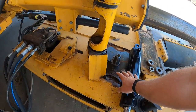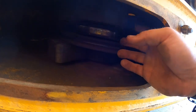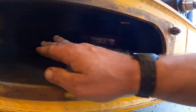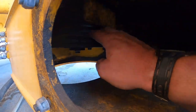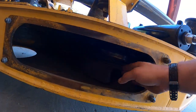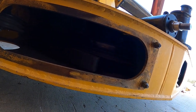So here's what we call our energy wheels inside here. These are the wheels that actually have the weights on them that cause the shaking action. You have your lower wheel and then your top wheel, and the way this works, the weights turn in opposing directions, and that's how you get the shake out of the shaker. There's a belt inside there that I took out, but it's driven off of a pulley right here, which is driven off of your shake motor, or your VOAC motor, as we call it. Like I said, it spins the weights in opposing directions and causes a shake.